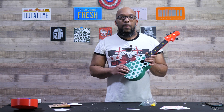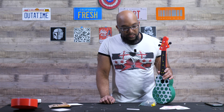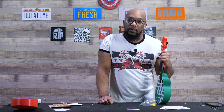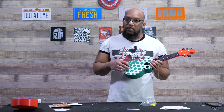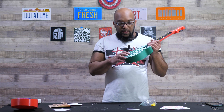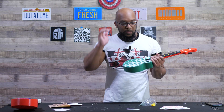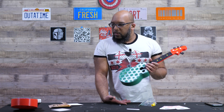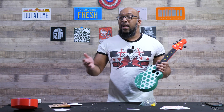I printed out the bridge bolts, which were supposed to be in PETG. The thing is, I have yellow PETG and yellow PLA both on cardboard spools. I printed the PLA thinking I was printing PETG, so when I was screwing in those bolts, the torque eventually split them in half and left the lower half stuck in the holes. I thought about it and realized that with guitars and ukuleles, they usually don't screw the bridges in — they glue them down.